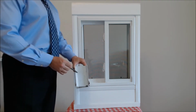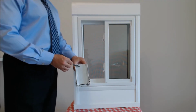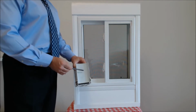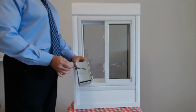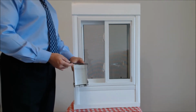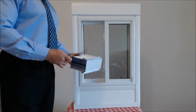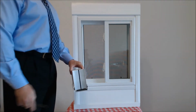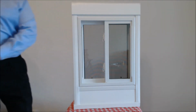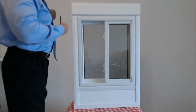The aluminum substructure again with no thermal breaks. Less money to manufacture it this way without the thermal break here, although it will sweat and condensate if you do heat and cool that space. So we do offer both options in our vinyl rooms and our aluminum rooms, but highly recommend the thermal extrusion for the aluminum. Window options vary a little different for solarium conservatory.